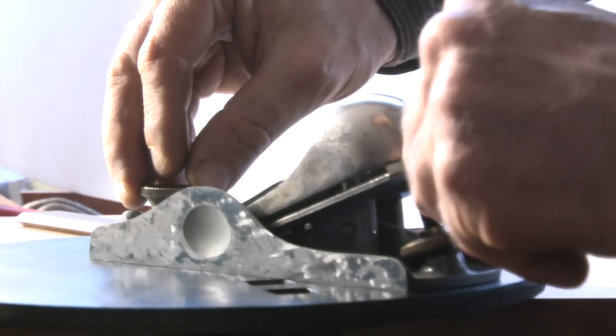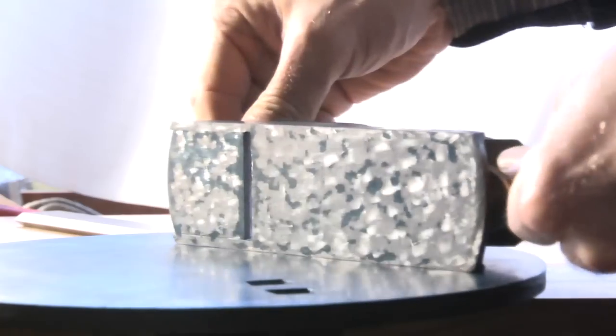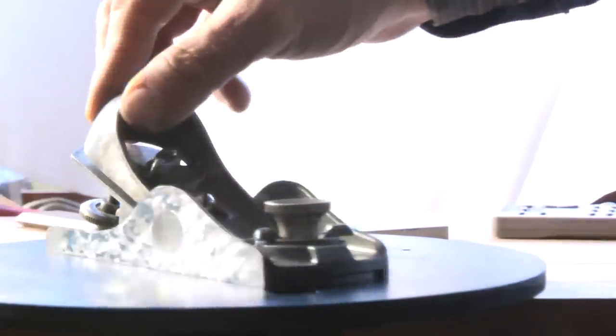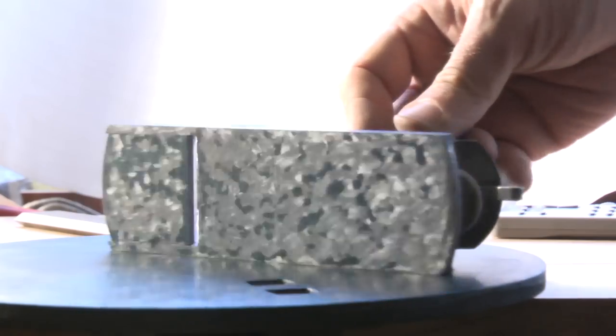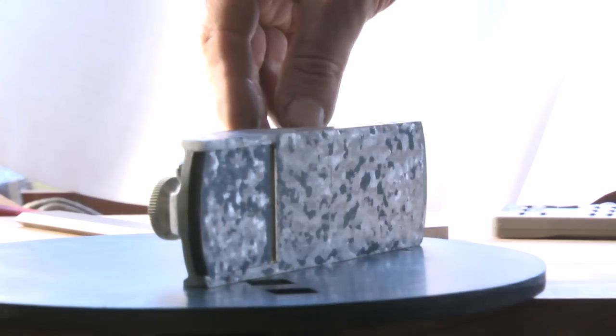See, I couldn't manage to get contact points at the edge to the base, but it's not such worse. But anyway, using belt sanders for cleaning up the body of a plane is really not the way how it should be done. There seem to be less contact points than in the previous part of the video, but this is due to the fact that now there is much less color on the touching plate, and so the interpretation of the touching image needs practice as well.